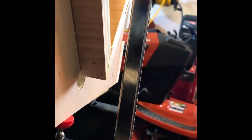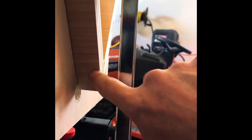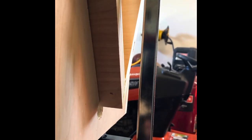you can see that I used my air nailer to put in some 1¼ inch finishing nails here to hold it. Given this angle, 1 inch from the tip, I drew a very faint pencil line the whole way across, and 1 inch in with a 1¼ inch finishing nail is about perfect. It goes through about 80-85% of the way, but won't blow through the other side, and it's in a really solid part of the joint, so it should hold real well. I just did 4 on one side and 4 on the other side, offsetting, so that we've got nails on both sides, holding everything together.